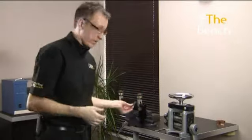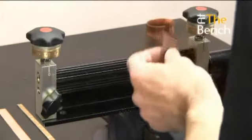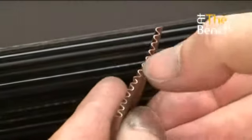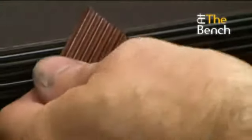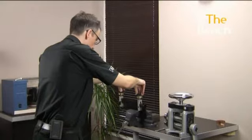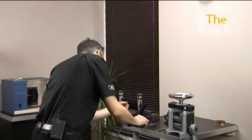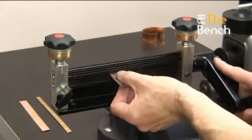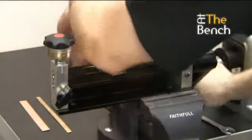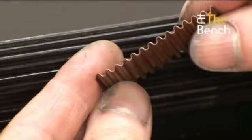This is 0.3 millimetre — you can see how lovely that is. It went through nice and easy and the corrugations are nice and deep, nice and crisp. If you wanted to, you can always turn the thumb screws a little bit tighter to make the corrugations as deep as possible — just hang the first part onto one of the pinions and run it through again to get really nice, tight corrugations.